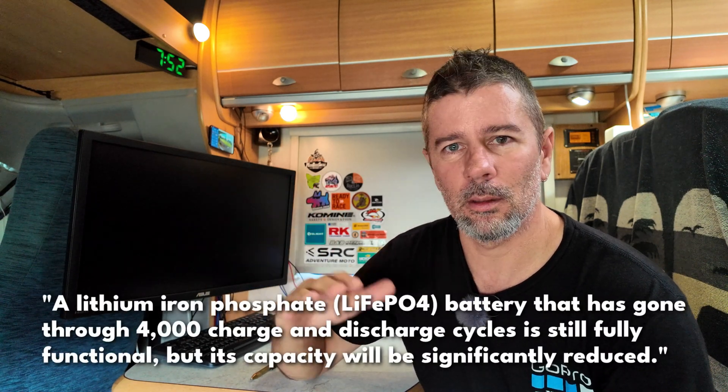I've never seen my 480 amp hours ever go below 50%, so I should be able to make do with the single 230 amp hour. It may get down close to zero, but it should still meet my needs just fine. If I was to discharge that one battery all the way to zero every day and then recharge it back up to 100% - full depth of discharge cycling every day - that does shorten the life of these lithiums, but this particular one is still rated to 4,000 cycles. At 4,000 cycles divided by 365, that's almost 11 years, even if you mistreat that battery by discharging it to zero every day.